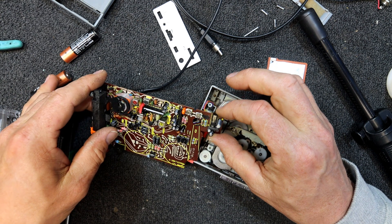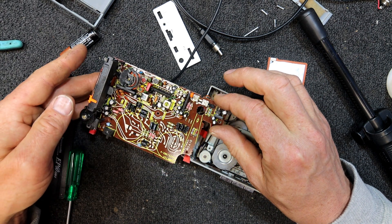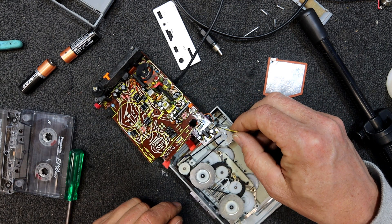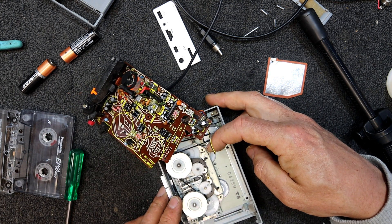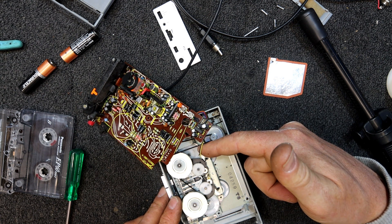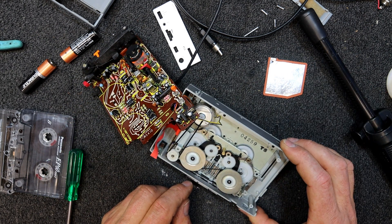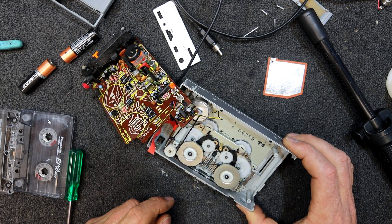We've got one of these circuit boards with the printed stuff on it — with 'PRC HDK' on it. I wonder if that was one particular company. That actual power socket's pin is bent — thought it looked a bit close to one side of the socket. Someone's done something there to it. It's actually in better condition than I thought — maybe it's just a bit dirty. I've got a couple of trim pots there, a little radio dial cord — so it's a mechanically coupled one. These are full of those little smaller electrolytic capacitors that can play out, but generally these didn't run hot. We've got a date here — 19th of April 1984 on the motor, which is a Matsushita. Always nice to see a date. This is a mid-80s one. I don't think we need to actually take the mech out — there are a couple of screws there that probably flip it out.